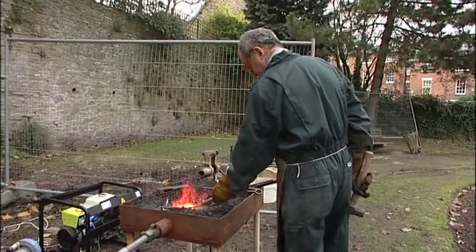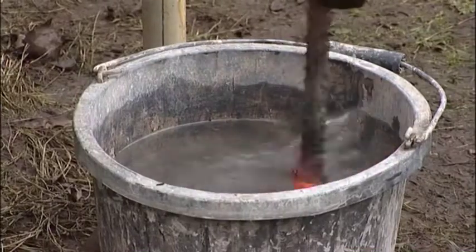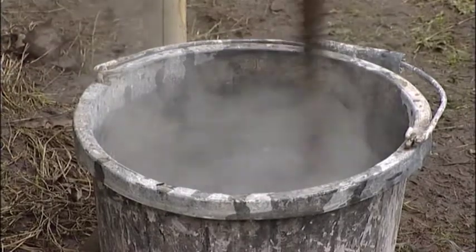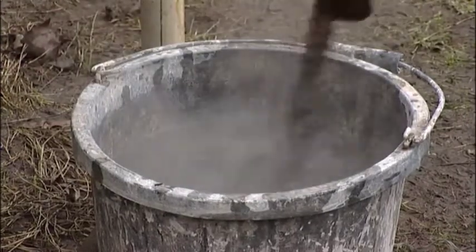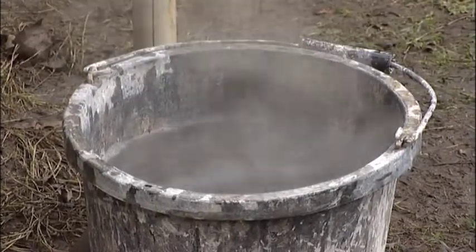After cooling, the metal is again heated to cherry red and then quenched in cold clean water, agitated to avoid any stress cracking which could result from too regular a line between the immersed and unquenched sections of the tool. The metal is then repolished to allow the tempering process to take place, and this occurs by observing the colour of the steel moving down the workpiece to the tip.